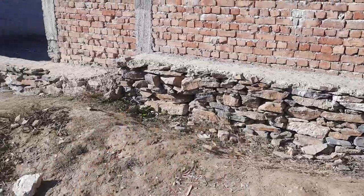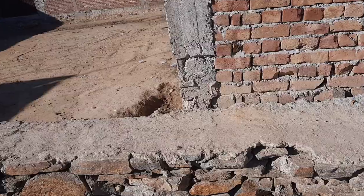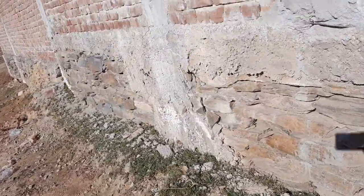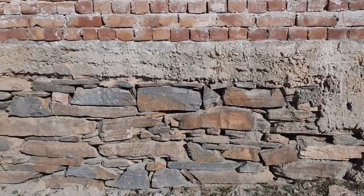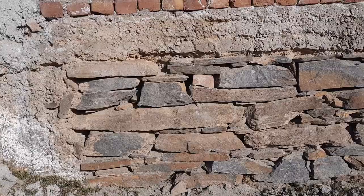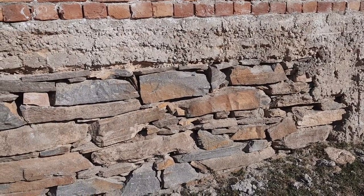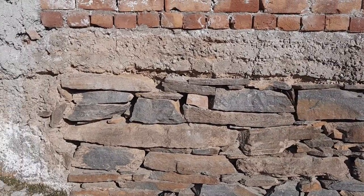Let me show you — this is the back side of another house. The first priority is to do cement plastering. Also, they should apply asphalt on the outer side along with a plastic or polythene sheet for proper waterproofing protection.